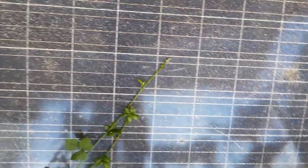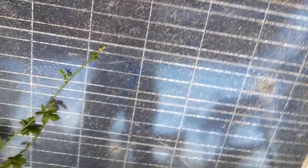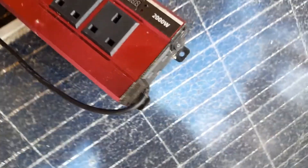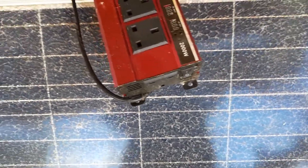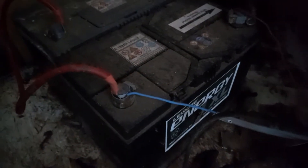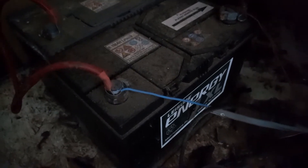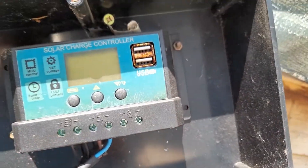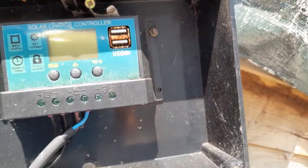If you're going low-end, you'll get away with potentially broken, cracked panels like I've got here, as they're super cheap — about 20, 30 pounds. A little cheap Chinese eBay inverter will do to come off your batteries, like this one. Your cheapest batteries are just going to be old car batteries, like this — wired in a 12-volt block. You add the two together to increase the amount of power you can store. Then you'll be wiring all those things into a little charge controller like this — super cheap, 10 pounds and up on eBay. That's all stuff I've got from the very first system I put in here, which was primarily for charging tools. We did run a little fridge on it for a while, but it kept draining the batteries quite heavily.